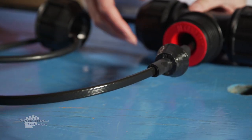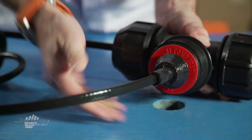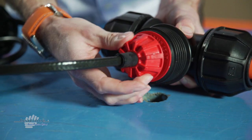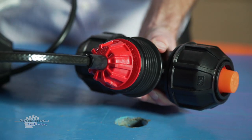Reposition the heat line grommet into the red seat associated with the tee fitting. With the lubricant applied, position the red reducing cone on top of the heat line grommet. I commonly spin the reducing cone just to ensure an even coat of lubricant is applied.